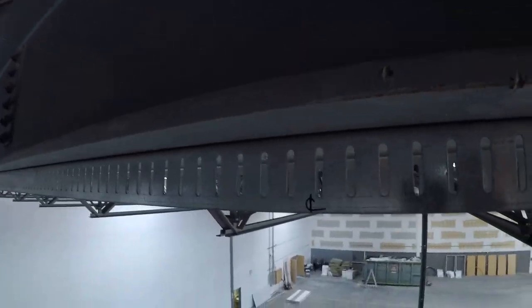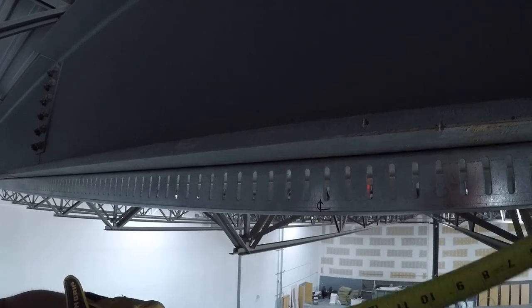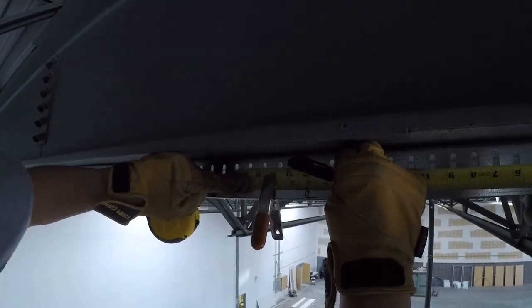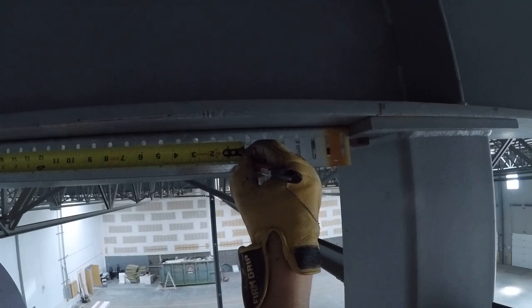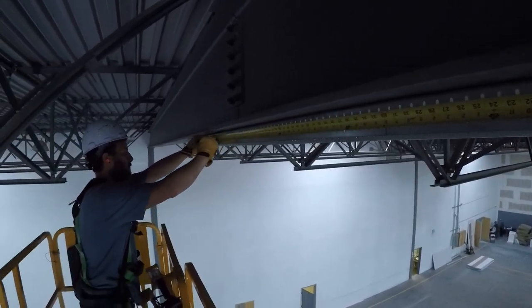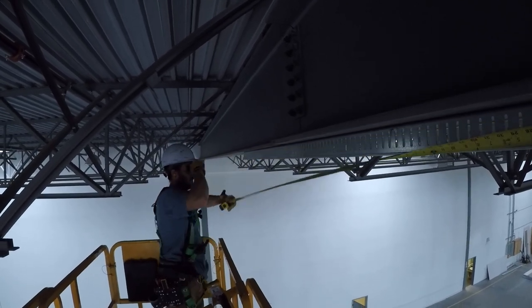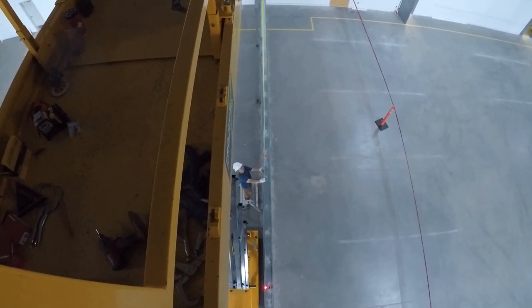I have a little trick I'm going to show you for pinning up the track and plumbing up your centers at the same time. I always clip my tape at the 16-inch mark if I can — it's just more accurate. I mark that, and that's going to be a center there — 16, 32, 48. Every time you put a piece of track on, do your layout so you don't have to come back and do it. Do your layout and measure your height as well. The 100-meter tape is nice for high walls; even the laser distance finder we tried, but you have to be perfectly square.